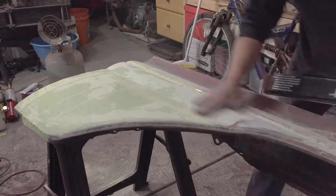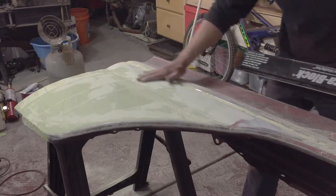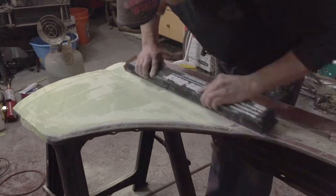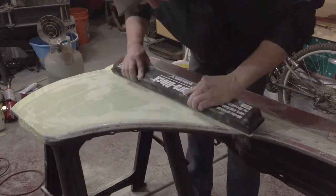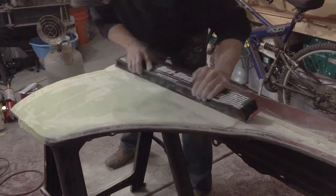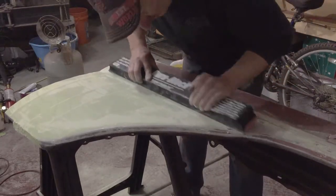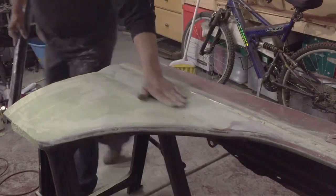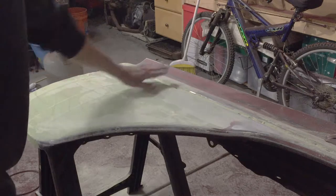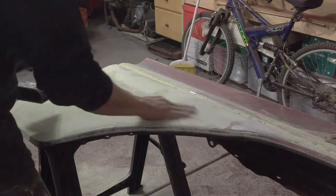You can start to see some shiny metal. You'll probably have a little bit of a low spot right here so we'll keep sanding it. The valleys like this have a tendency to build up a little heavy when you're spreading the filler — it's the nature of going back and forth across it. I'll concentrate on thinning this out as it is. It is pretty thick.